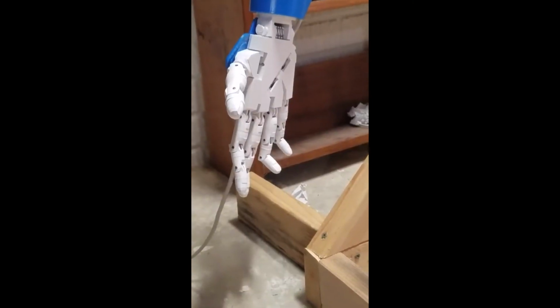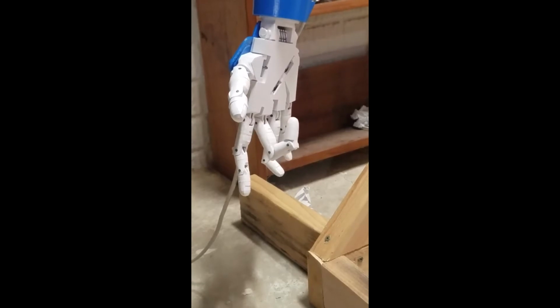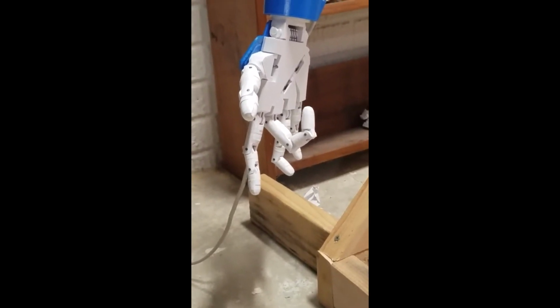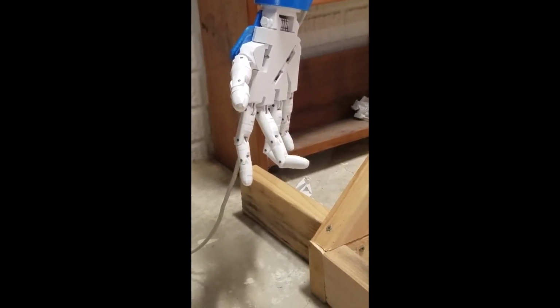So my main goal of this independent study was to program a 3D printed arm to grab an object and to recognize that object through AI. Throughout this independent study, I attempted to use several different things to accomplish this goal. In order to control the servos, which are powered and twist to make different parts of the robot move, I decided to use an Adafruit I2C driver.